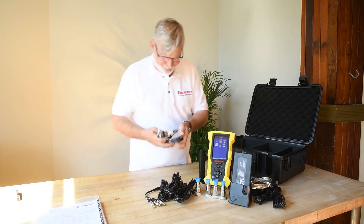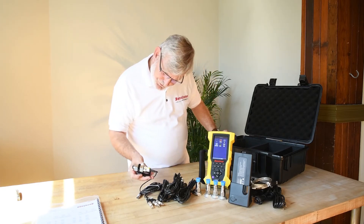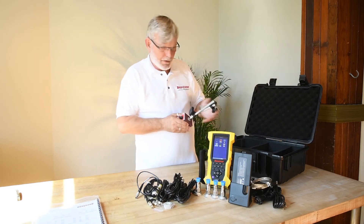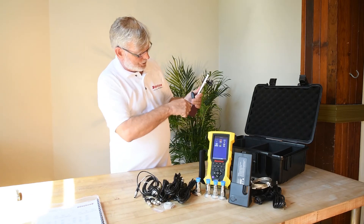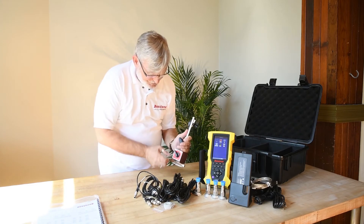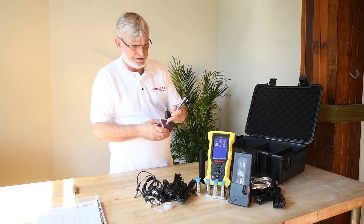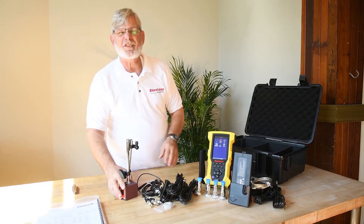This is your tachometer — laser tach. Laser two. Reflective tape. The holder for the tach has an on-off switch; it drops the magnet down so it can engage. And then you go off, it reduces the magnetic signal, so it comes off the machine easily. You'd put this on and then mount your tach — it just makes life easier.